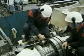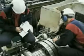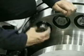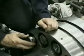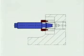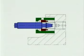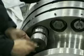The second stage of fitting is to preload the bolts to ensure that the flange faces are in contact and to lock the nuts. The nuts are then fitted to both ends and hand tightened. The nut driver and adapter are then fitted. The distance collar is fitted over the adapter, and the tensioner is screwed onto the adapter and hydraulic hoses are connected.